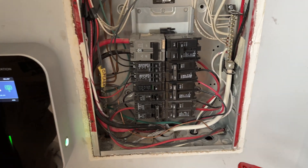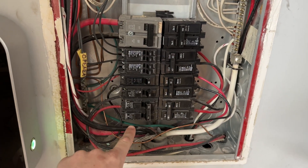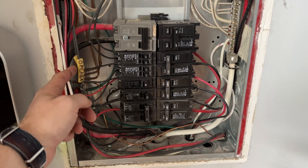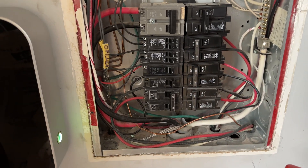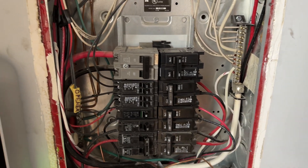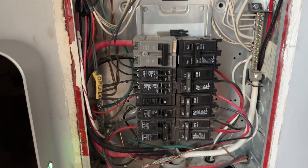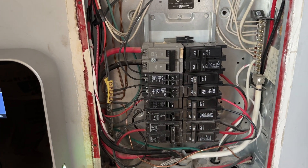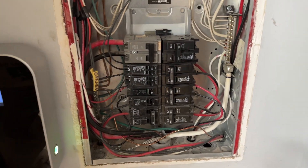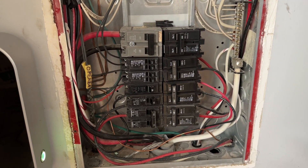I'm in an association so there's a breaker outside, which is really handy. I'll find probably my smallest circuit — unfortunately there's no 15-amp because this is all commercial — so I'll probably pull the circuit for my garage door opener and wire nut the Emporia into that. This is a split neutral, which is a little better. I'll need a neutral as well to power up the Emporia, then get the clamps on the primary.